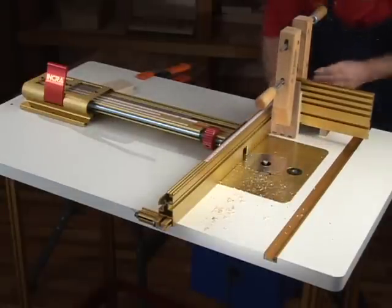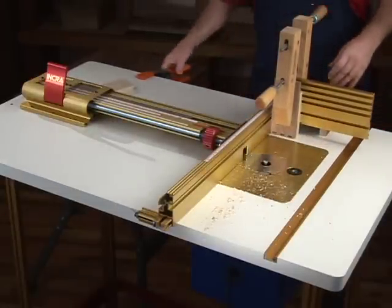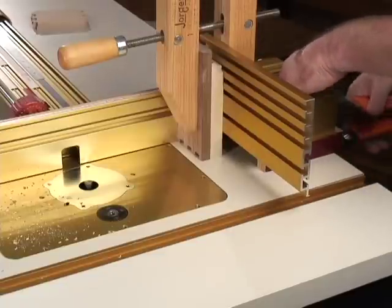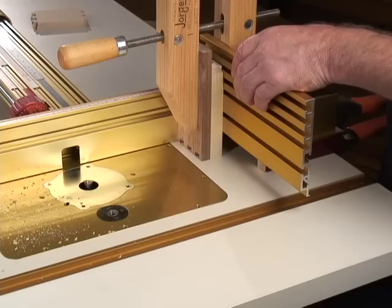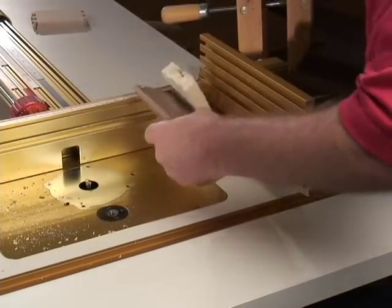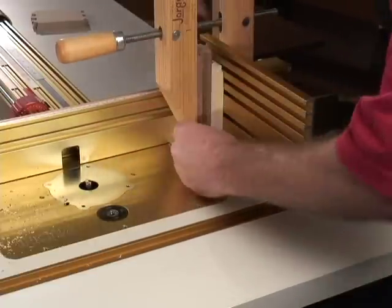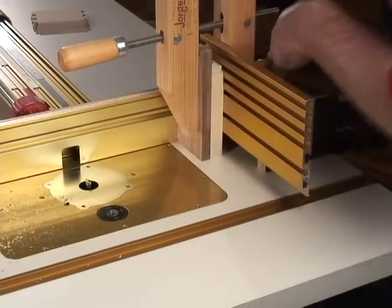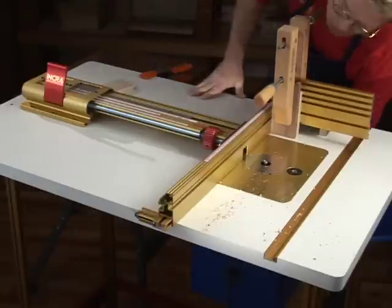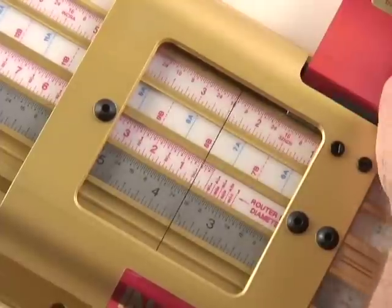After completing the cuts on this end of your two pin boards, return the right angle fixture to the end of the fence and clamp to the fence and table. Allow the cutter to come to a complete stop before unclamping your two pieces. Now, flip the stock and reclamp. Repeat the pin series of cuts across the full width of the boards.